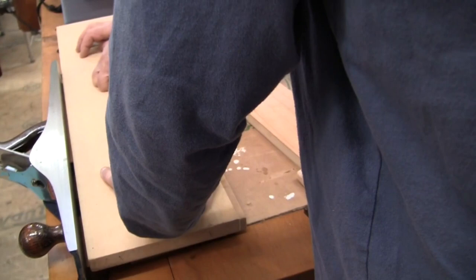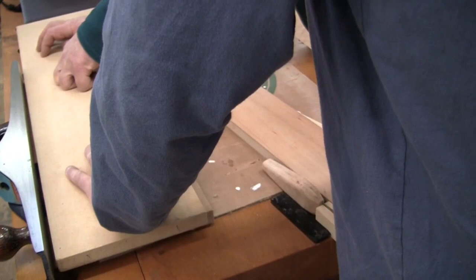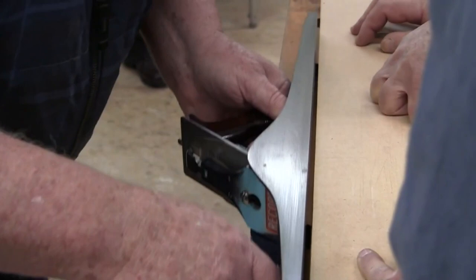Now, when you're doing that stringing I was talking about before, for some bizarre reason, after you do two or three of those things, the source piece develops a bow. So you need to shoot it to flatten it out again. I don't know why it does, but it does. Now, this thing looks flat, but all I know is that the top piece is flat because I didn't get any shavings or a full shaving. So I'm going to register the front, come across.